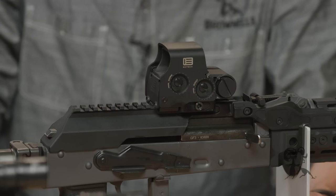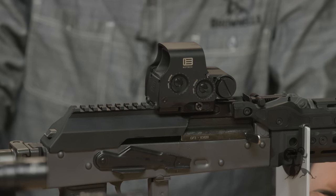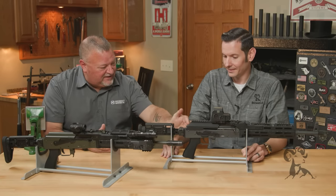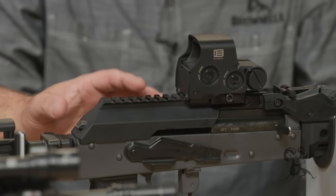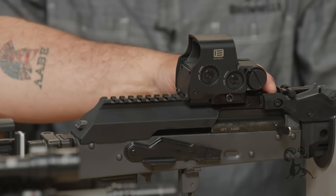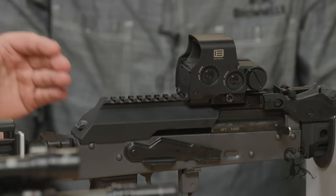The other thing you have to do is have adjustability for the different guns, because this slot is not the same on every gun. You'd think it would be, but the receiver lengths vary. And people are like, oh, no, they're not, but they vary. You have to be able to have this thing fit in here and have adjustability. So the cover itself needed adjustability front to rear to accommodate the rear locating portion where the cover goes into. We have adjustability up here in this trunnion area that allows the cover to slide back and forth just enough to make sure everything fits.